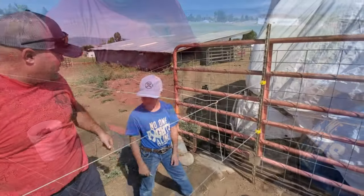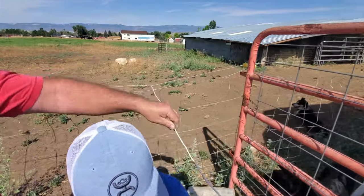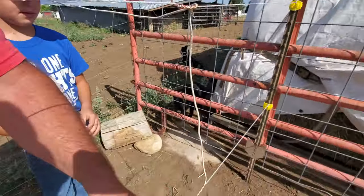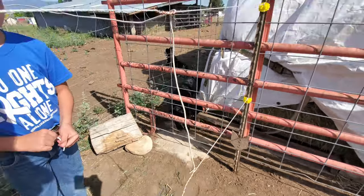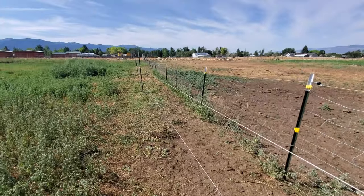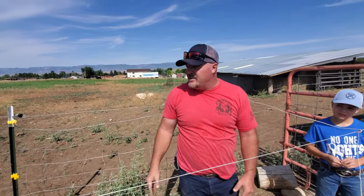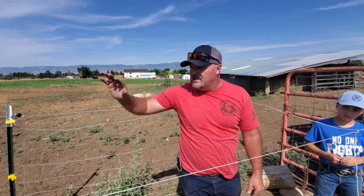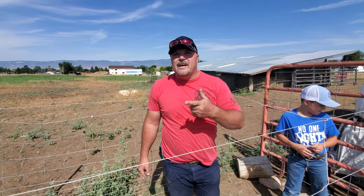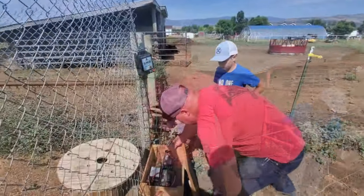Okay, so here's the finished product. Your circuit's coming from this hot wire, goes through here, ties into this one going down — so it's going to energize both of these wires as it goes down. Once we turn the controller on, we've got both ends isolated, the middle is all isolated, we should be good. No weeds, nothing — they're all on insulators. Your controller will tell you that. So we'll head over to the controller.